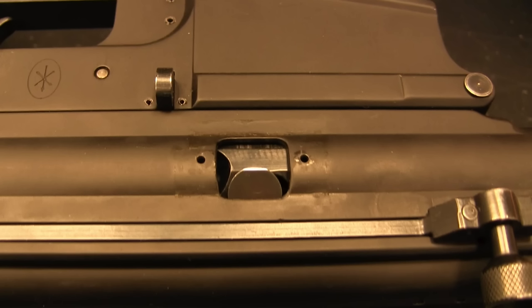This kind of leads to a deeper question of what makes guns profitable or successful, and there's a lot more to it than just whether it's a high quality design. What often happens is someone will come up with an idea, get a prototype, proof of concept, and then an early production model. The early production model pretty much always has problems. The Hack 7 is like that — they have a little cover on the side where they machined out the locking lug, and just to simplify production they put a little sheet metal cover on it, riveted in place. Those things fall off because the rivets wear out under stress and break. That's something that would need to be revised. You get an initial version with some flaws, and then the more it gets used, the more it gets improved.